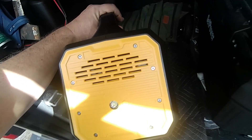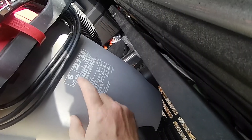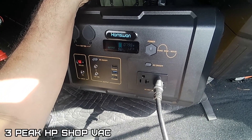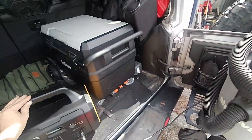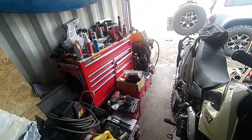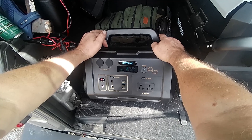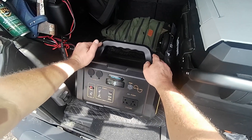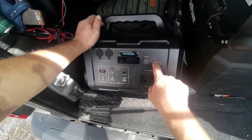Just had a little fan kick on — must have felt that extra current trying to start. So a 3 peak-horsepower unit — let's see if this will run it. It says it'll run in an hour. Running out of things to try. I know it won't run that welder, that plasma cutter, or this pressure washer — this draws like 13.5 amps. Pretty impressive to have over a 1,000 watt-hour battery with a 1,000-watt unit. That's a good match. If the battery matches the output and this is pure sine wave, as opposed to modified or square wave, it's good for sensitive electronic equipment.